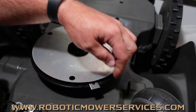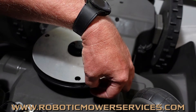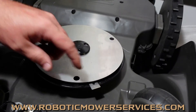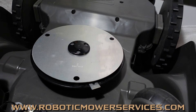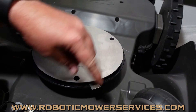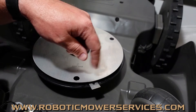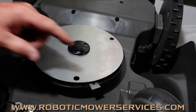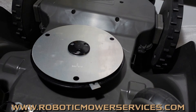What they did with the new style was make the shield smaller and the cutting disc larger. You can see that with the endurance blades, you have more blade surface sticking out — since the mower is upside down here, you'd have more cutting surface of the blade facing towards the grass, getting more cut out of every revolution. Because of the slot in the endurance blades, you're getting more cutting surface being used, whereas the single-hole blades only spin around and don't slide back and forth. This made a huge improvement in how these mowers cut and their overall performance.